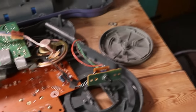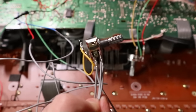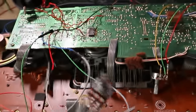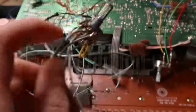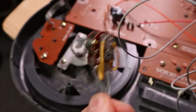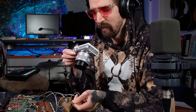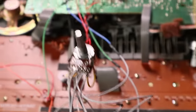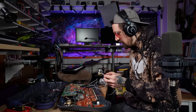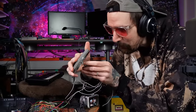So what I am now gonna try to fit in there is this, which is a stereo potentiometer, where it's completely the wrong value for the circuit bend of the patterns and keyboards and stuff. So I had to do this really janky trim pot situation, dividing, so to speak, this one now tuning both the pitch of the samples and the patterns and stuff, and I'm gonna see if I can get it to be in here.